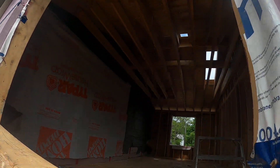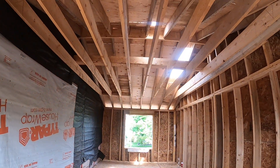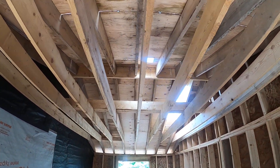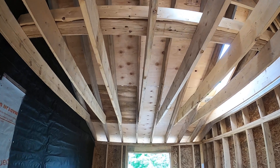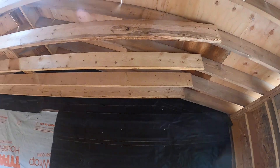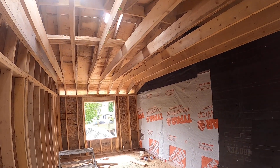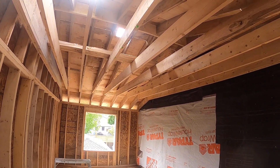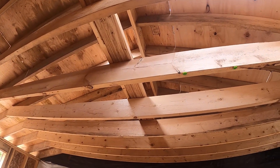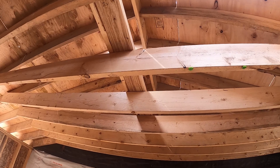So it's a 4/12 roof with a 2x10 ridge and collar ties. The inspector wouldn't let us go full height, so it's going to be a finished 8-foot ceiling. On top of the ceilings I've given it a T-brace, which will help keep the ceilings sturdy and eliminate any bow.